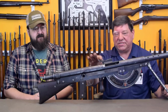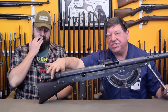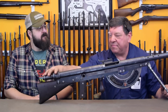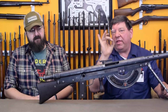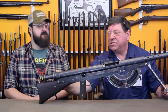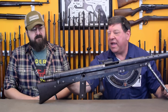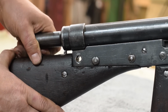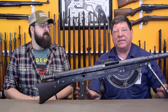There was that. We had issues with sights. This rear pin fits in a D-shaped hole, and there is a retention spring missing on the back of it that we discovered was gone, and the D-shaped hole had wallowed round, which allowed this pin to come out and rotate in just such a way that the entire action tube was allowed to pop up about 1/8 of an inch. And what that did was take the trigger mechanism out of the loop, and the gun went down.